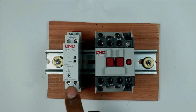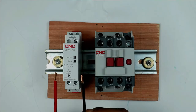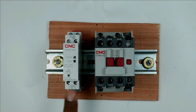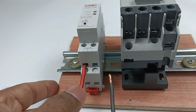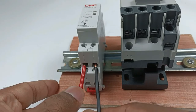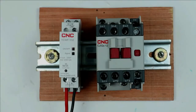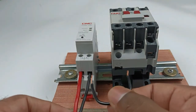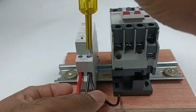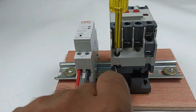To operate this Wi-Fi controller, a 230-volt supply is necessary. I am using two wires — one for phase supply and one for neutral. You can find the L and N terminals on the controller. Connect the phase supply to the L terminal and the neutral to the N terminal. We also need to provide neutral supply to the contactor, so loop a wire from neutral and connect the other end to the A2 terminal of the contactor.